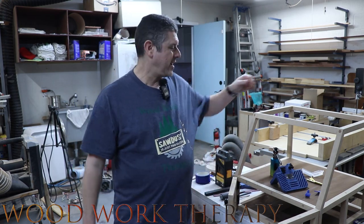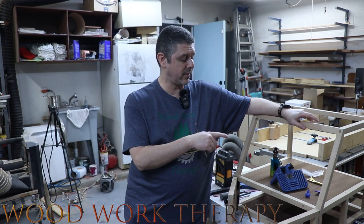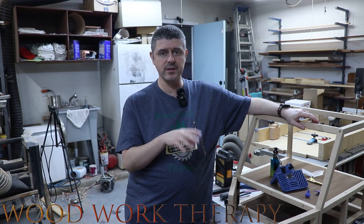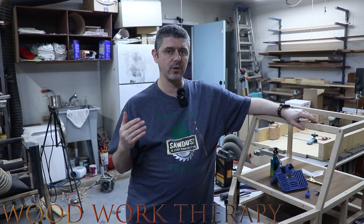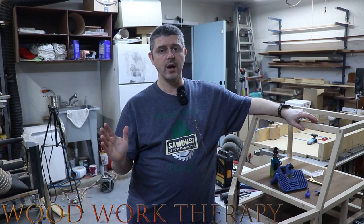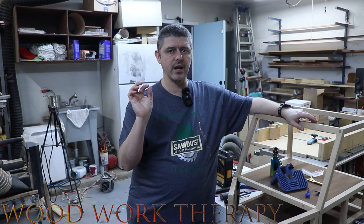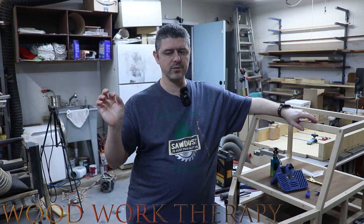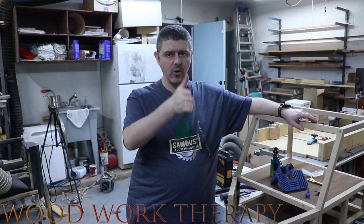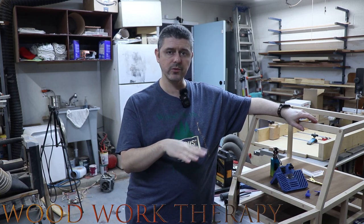It won't work. Anyway, you don't have to have a doweling jig, but you do have to have something that has a stop collar on it for the bits. This way you don't go too deep, because of course we don't want to go all the way through. We want to go through roughly the thickness of the actual magnet times two, and this is so we can put a dowel over it and then make it look like it's all enclosed,